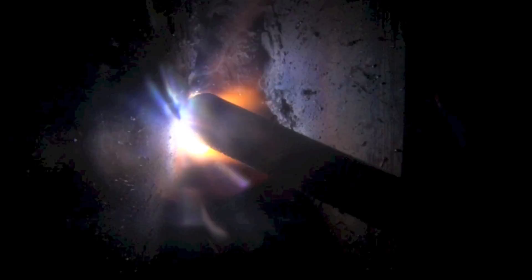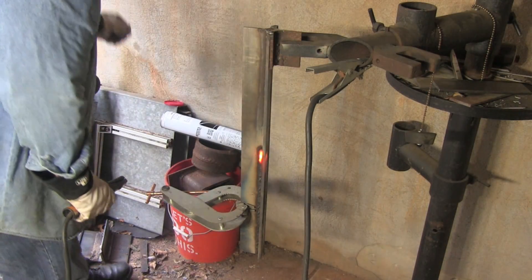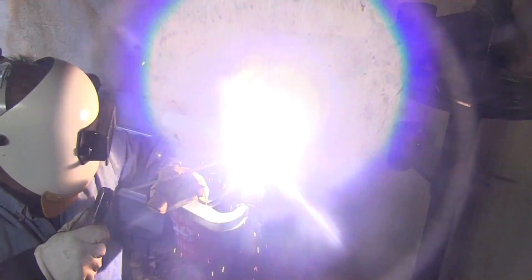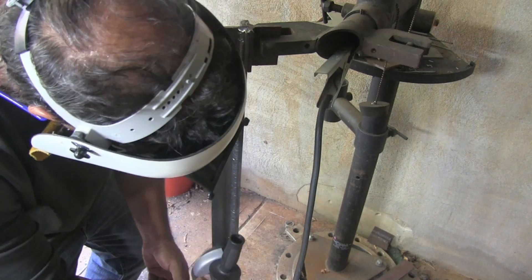That's kind of exaggerated — usually you'd come down a little bit quicker than that. I also try to stop on the same side every time and then light up on the side where I stopped; that tends to help. We'll do a quick restart here in just a minute — you'll see me stop on the left and then light right back up on the left. The quicker you can get back in there the better. If you take a long time, you need to really chip slag and brush. But if you can get back in there really quickly when everything's hot, that's more benefit than any chipping and brushing you can do — it just melts right back together.